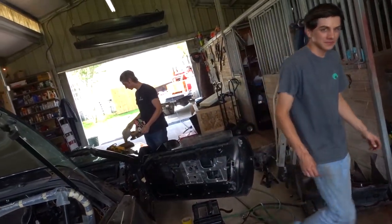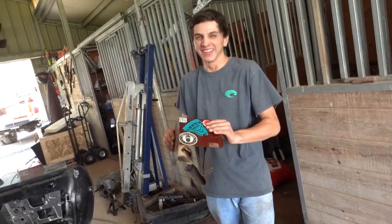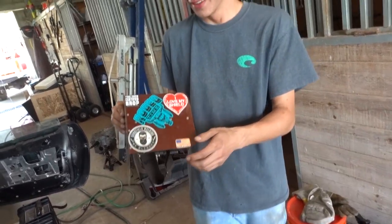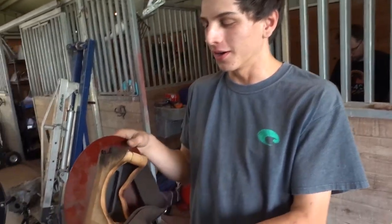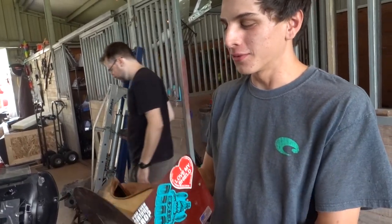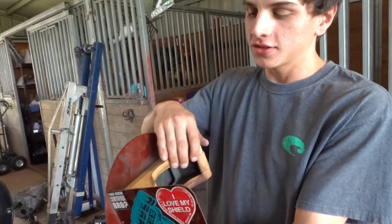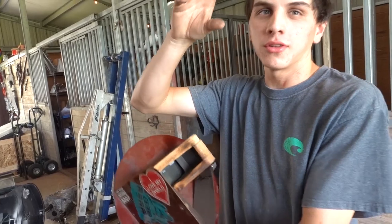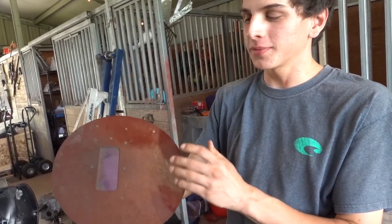Hey, can you guys explain your pancake mask? Because in the videos, people all make fun of them. Yeah. But they don't know that you actually want this mask for a reason. First of all, everybody thinks we made them or something. We didn't. Yeah, everybody's like, oh, those poor boys have their homemade mask. It's a pipeliner, really solid hood. It basically molds around your face, so that way external light doesn't come in and blind you and make a reflection. Gotcha.